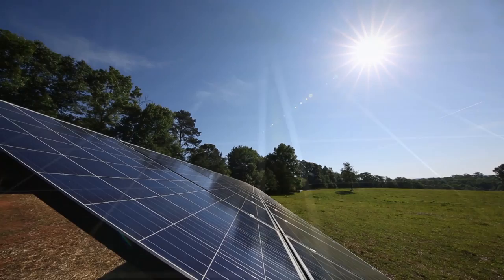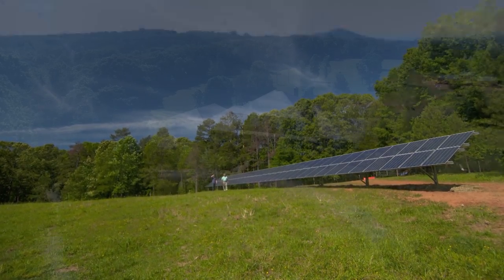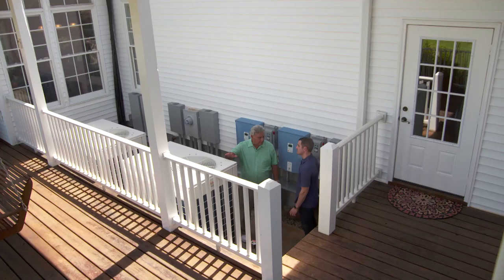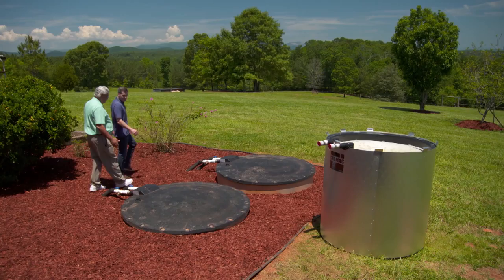When completed, this solar array will have 144 photovoltaic panels providing 40 kilowatts of power. A wind turbine will generate electricity at night or on cloudy days, and a battery bank will store unused power for lighting and appliances. The solar array also powers these chillers, which as a system are more efficient than a conventional air conditioning unit. Think about the insanity of how that equipment operates — it takes heat from your house and exhausts it outside, and it's wasted. What we were able to do is capture that heat: we pull the heat from the house and put it into a tank for hot water — available for household hot water, the swimming pool, whatever you'd like. In winter, we can pull heat out of the air even as low as 20 below zero and move it into the structure or into a storage tank. The magic of this is that you're not making heat, you're moving heat.